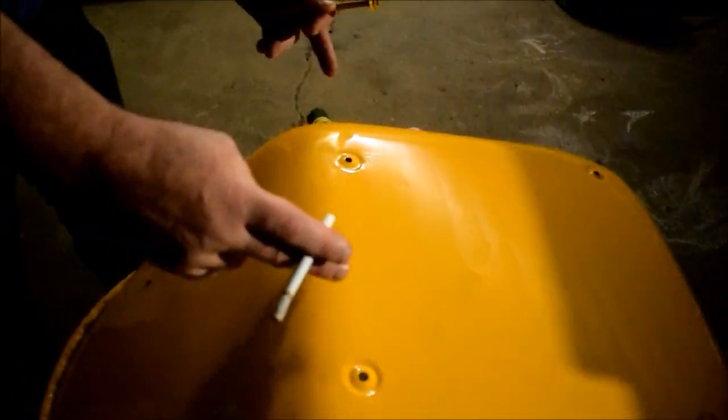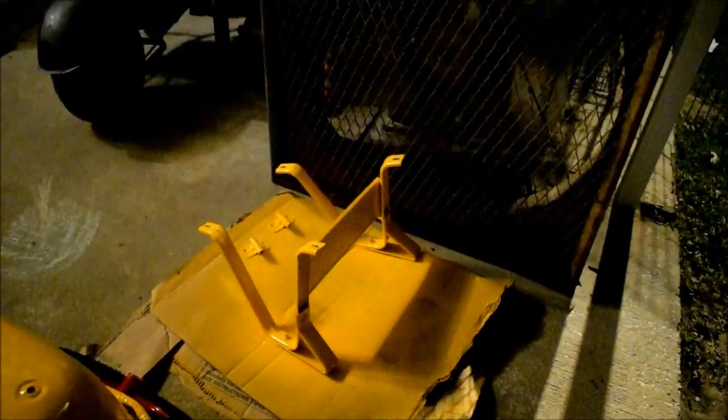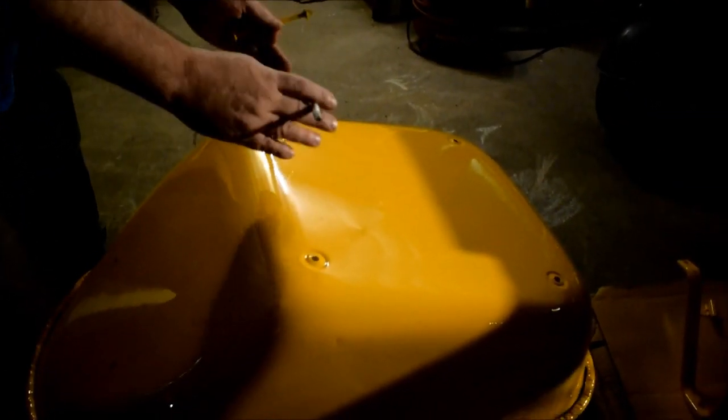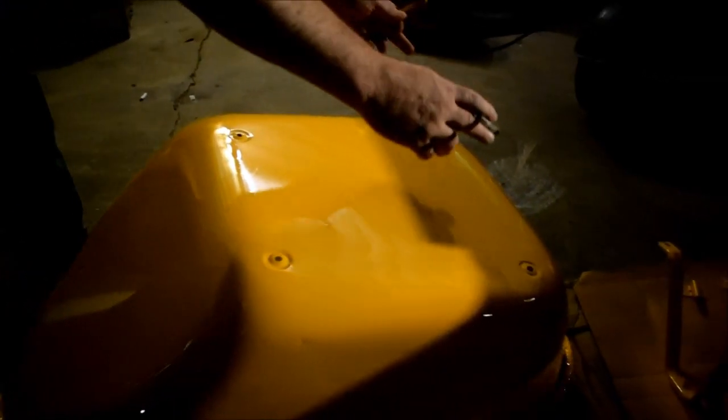And we also notice that we're missing some metal cross braces that, after the handles are put on and before the frame is bolted on, they go under. It's flat bar steel that goes across that supports it from racking this way and that way. So they go across this way. That wasn't even on this particular wheelbarrow assembled. So someone took some shortcuts possibly and assembled this out of the box without it correctly being assembled. So we don't have those pieces of steel, but we do have flat bar, flat aluminum, and other types of various flat steel that we can make those cross braces with.